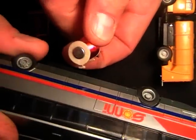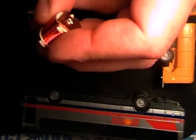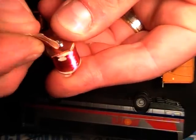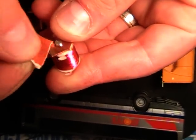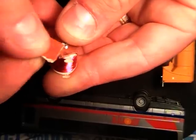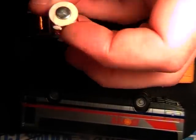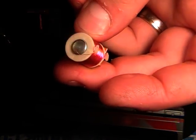When the bus or your truck rolls over that, it will stop it in place. All you need to do is just sand back this little point here — just get a bit of sandpaper on this. So you just wear back the insulation that's on that coil wire. Do the same up the other end. If you like you can unwind it a tiny little bit, but be careful because it's very fragile — you can break it very easily. You can always wind that wire back up again.